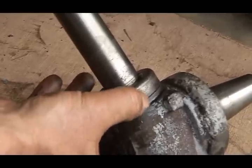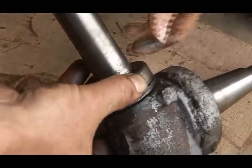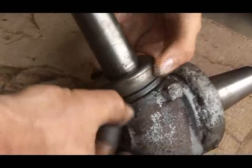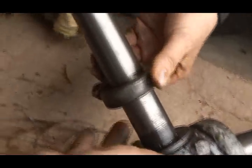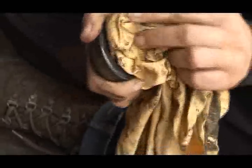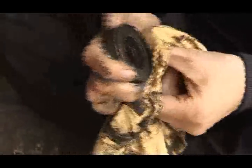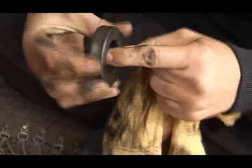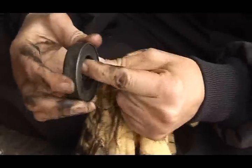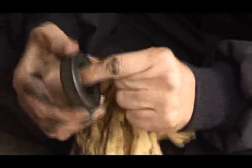I guess what's wrong is this is the thrust bearing. And there's movement there. Now, that's the movement you saw earlier when you examined it. So take that bearing off gently. Just easy. That's it. Take it off, right off the top. And give it a clean and give me your assessment of it. Just turn the inside and see if you feel even movement or is it rough? No, that feels quite rough. There's something wrong there. It's not smooth at all.